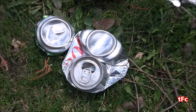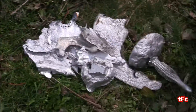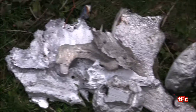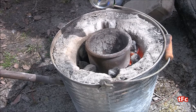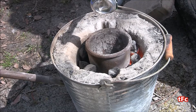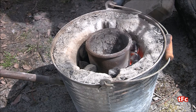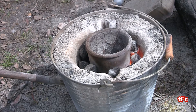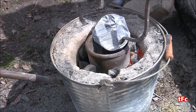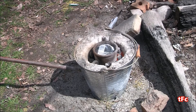For aluminum today I have a few pop cans, an old engine part from a car, and some scraps from previous foundries. I'm going to start with the pop cans because they melt really fast, and once there's some aluminum in the pot everything else melts a lot faster. I'll put two cans in the crucible and check on them in a few minutes to see what they look like when molten.